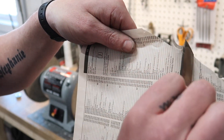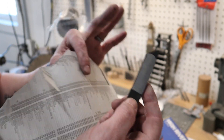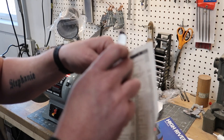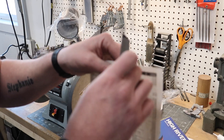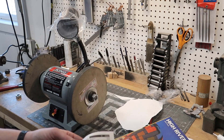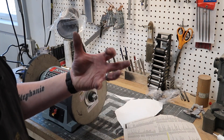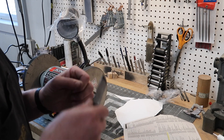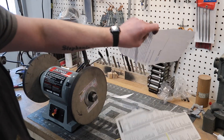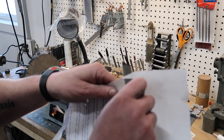There's a nice even edge on here — from heel to tip, it's sharp. A lot of times when you need to take it further, the blade will hang up somewhere in the middle. That's the main reason to do the paper test. When it was like a saw blade, yes it cut through paper, but that doesn't mean it was actually sharp — you could tell by the burrs it left. The paper test shows you the difference.